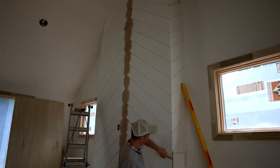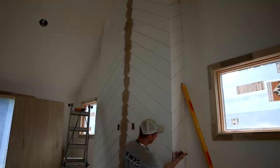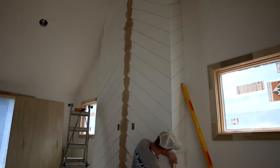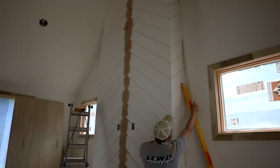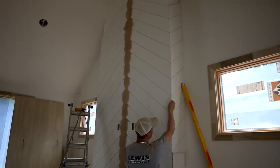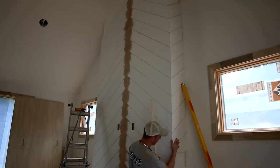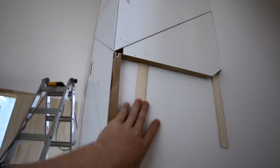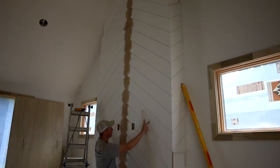When I made this cut I kept the inside of the cut off the drywall a solid eighth of an inch — you can actually slide this piece up behind there. I'm nailing the strip on the back side, but this I'm just nailing together. If it needs to shrink in the winter it's got space behind there to go in and it's not going to crack this joint. If it were pinned tight against the drywall and lost humidity and wanted to shrink, it could have pulled apart. With this setup I'm isolating the movement so it can come in and go out — it's not going to break this miter or this miter.